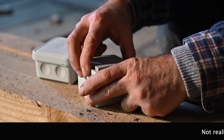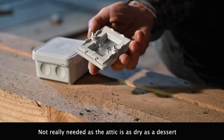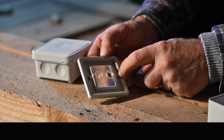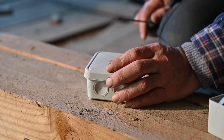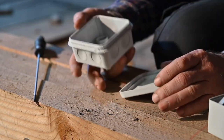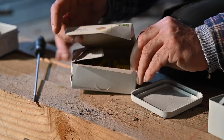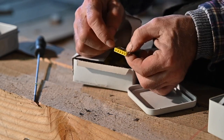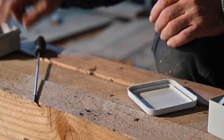I have a watertight light switch which I can open up and install. I'm going to bolt this down to the wall, and I'll have to take off the cover so I can bolt it down afterwards. This is a junction box which I'm going to need to make all the connections — I'll pry it open with a screwdriver. I have all the cables coming in, and I'll make the junctions between the different wires with these special click-on connectors. Let me start installing these boxes first.